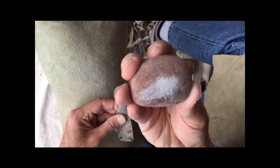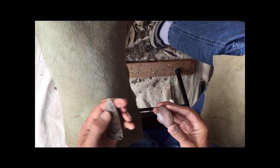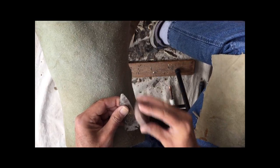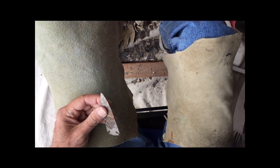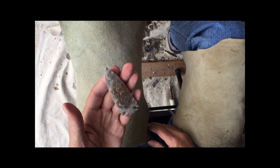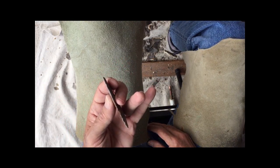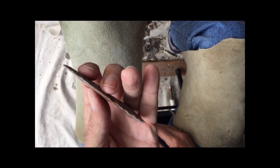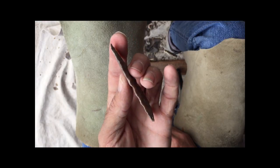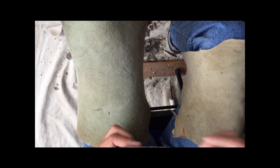I'm getting rid of scratches. I'm getting rid of vertical scratches. Vertical scratches are the enemy. That's where it starts when it breaks in half. So what I've just done is I've burnished all those off, and I've created a fairly stiff yet thin edge. And since it's stiff yet thin and more or less standing straight up, I can push on it, give me some flakes, and probably not collapse it. Be right back.